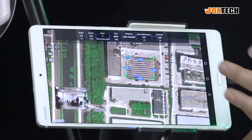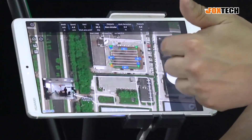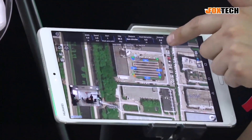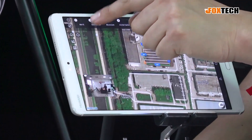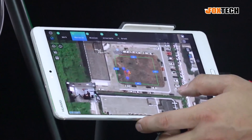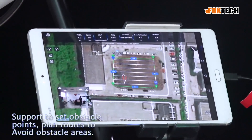If you want to set the spray width — for the Thea 160 the spray width is around four meters, and you can change it. You can see the lines become a little less close compared to before. You can also choose the start point, spray speed, and heading. If you want to draw out an obstacle, you can use the obstacle function — you just need three points. You can see the waypoints will go around the obstacle to avoid it. It's very smart.